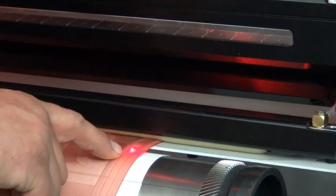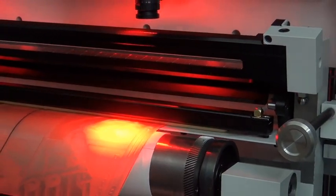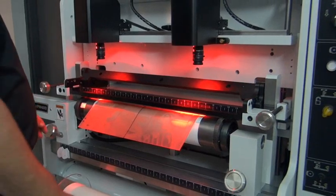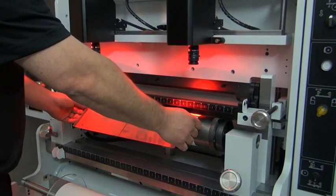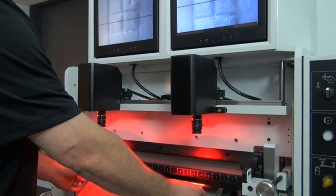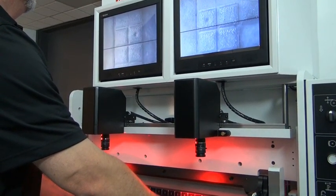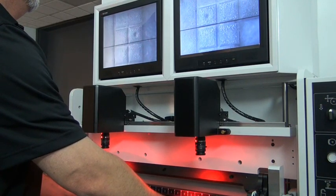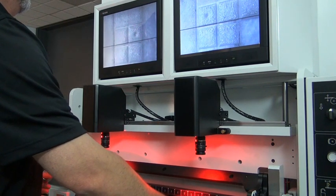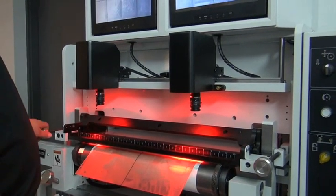Here you can see the laser light on the crosshair. Now I'm gonna lower the sight glass, unclamp the plate, and get a little bit better coarse alignment. Here you can see the crosshairs in the monitor — I pick the edge of a crosshair, get it close to the dark line, and reclamp. Then I use knob adjustments on the table to skew the plate into its final position.